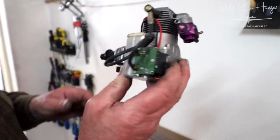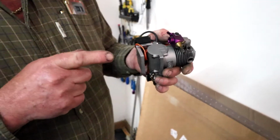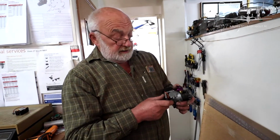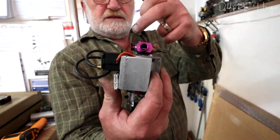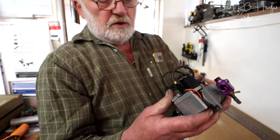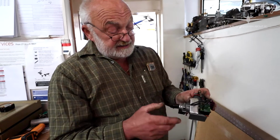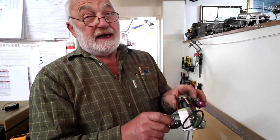but on an RCB. When you're converting to petrol from a glow motor, the main problem you've got is the carburettor, because you're going to use half the volume of fuel. So that's why we use this carburettor, which is off our West helicopter motor, and as you can see, it's got a spray bar going right the way across, and I can tailor the needle to give me a nice flow mid-range, because with a normal carburettor you can get the top end right and the bottom end right, and in the middle it's normally all fluffy and sometimes stops. But that's a single 700 milliamp LiPo, and that will run this motor over 3 hours. Wow.